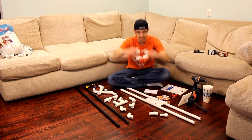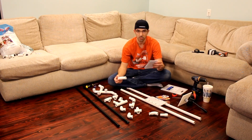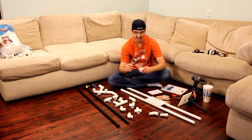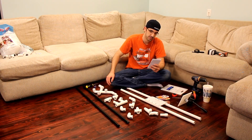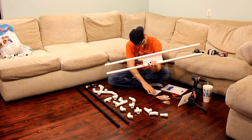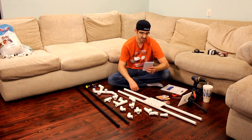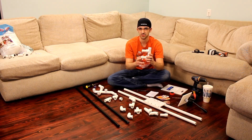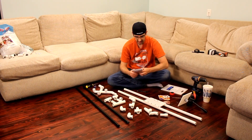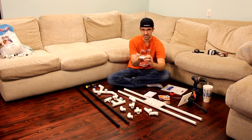These little connector pieces that you'll end up using, you'll want to slide them together. Each of these will be one and five-eighths of an inch — that's the length I used, so you can close your pieces tightly together and they should butt up to each other. You'll also need two 41-and-one-quarter-inch cut PVC lengths. You'll also need two two-and-a-half-inch pieces of three-quarter-inch cut, and two two-and-three-eighths-inch cut pieces. The two-and-a-half-inch piece goes on this part here, and the two-and-three-eighths-inch is actually part of the legs.